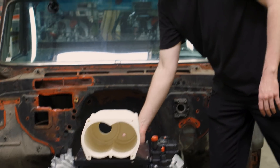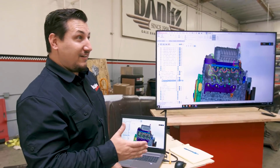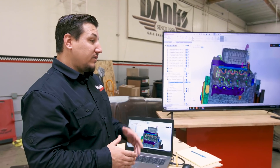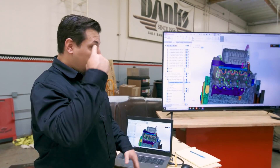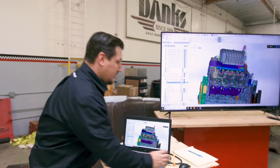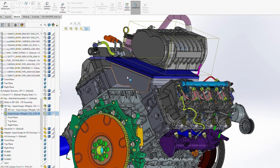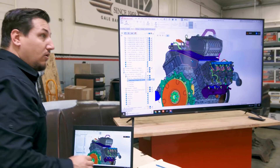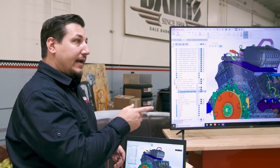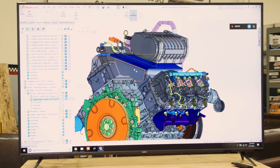Is this a single-pass core? All the fittings will be out back for the water, yes. The core is probably going to be designed this week — we're doing this in real time. What you'll see in an upcoming episode is water inlet and water outlet fittings, or a separate little water manifold that brings the water in, passes it through, and takes it out to our heat exchanger in front of the radiator. That's still being iterated right now.